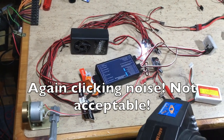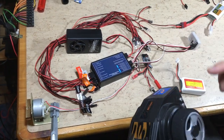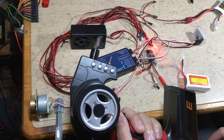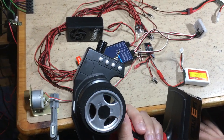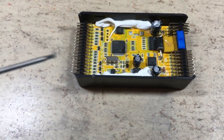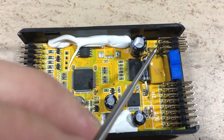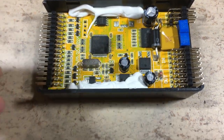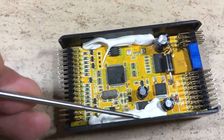So, here we go. What's inside this thing? An STM32 processor, 200 ohm resistors. We also have some nice bodges — this track is cut, they bodged in a poly fuse and an anti-backfeed diode. It appears that they really like hot snot.